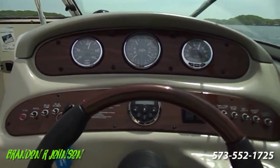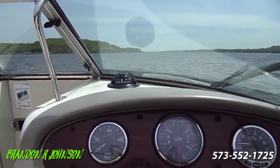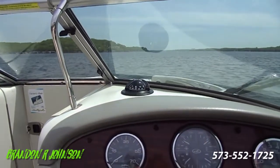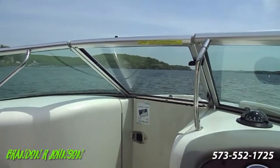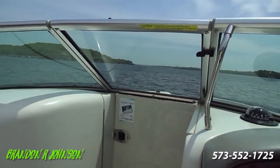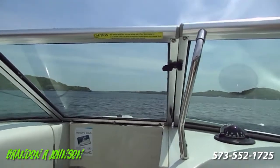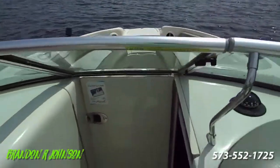Now I'm going to slow down and show you how to operate the trim. The anchor locker wasn't latched, but Billy fixed it. A few things before we do the trim tabs. Number one, I always shut this windshield because it fits perfectly. In time, it begins to bow against this side. That's why I always shut that. If I'm idling, no big deal.